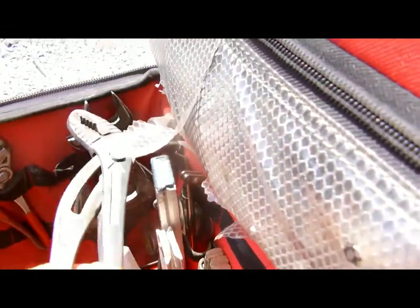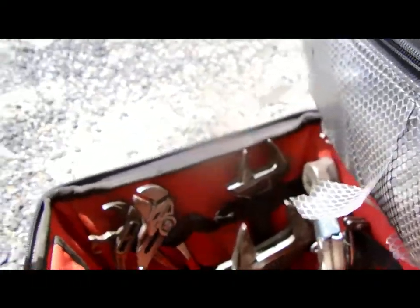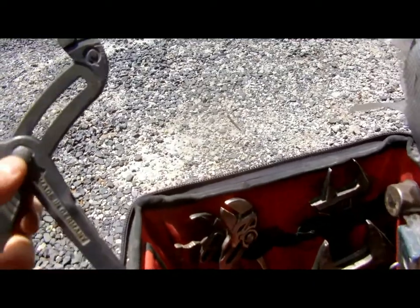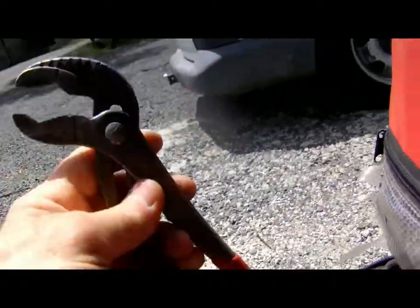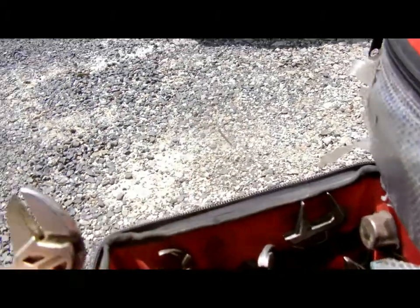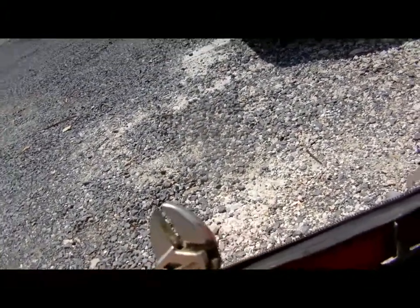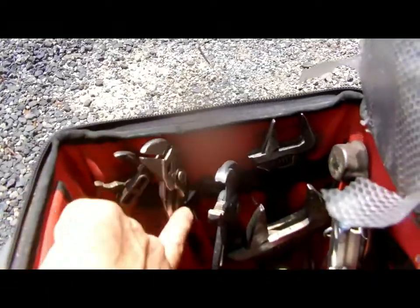In America they're called channel lock, in Australia these are called multi-grips, because literally you can grip pipe or fittings at multiple sizes, so I still call those a pair of multi-grips. These are my new favourite, Knipex flat face multi-grips, or flat face channel locks, good for chrome plated nuts, doesn't scratch them.